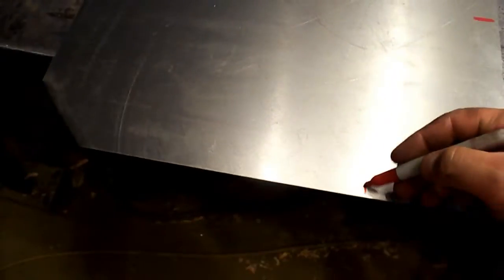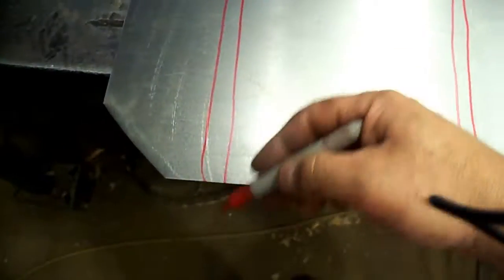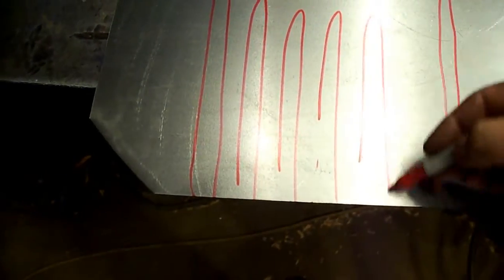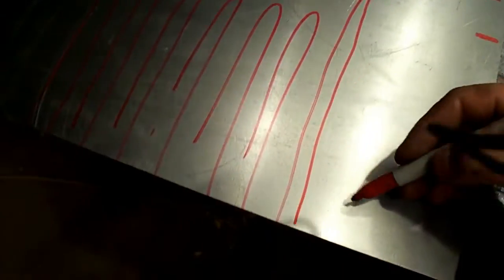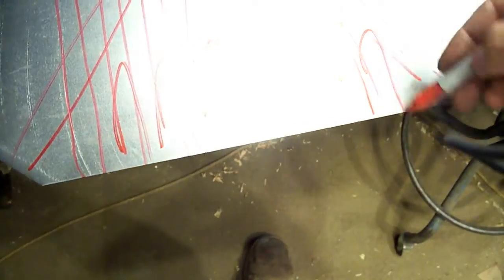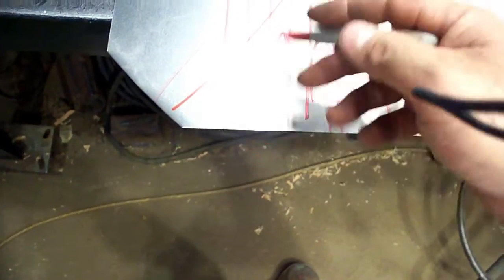Kind of dark, you can't see it, but we're going to take our shrinks and we're going to go in here, come back out, and here, come back out, and we're going to keep putting shrinks in this area here. And then maybe we'll come in a little bit this way and a little bit this way, and we'll have to double shrink the bottom because that's really where it's got to get shrunk a lot. And we'll just see how it's coming out.